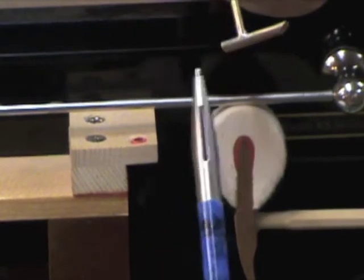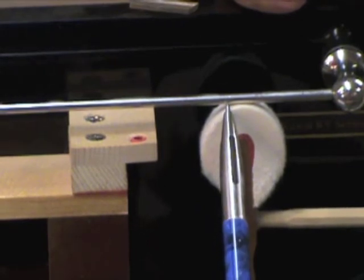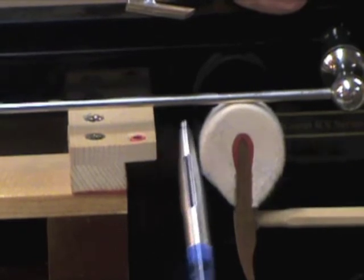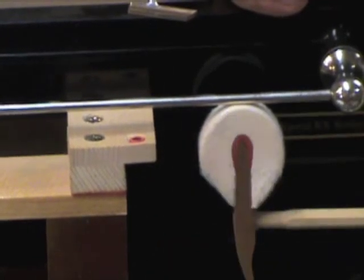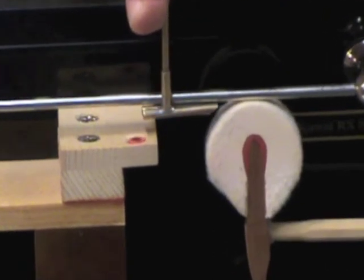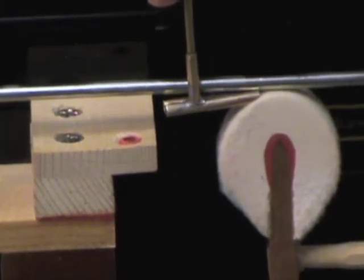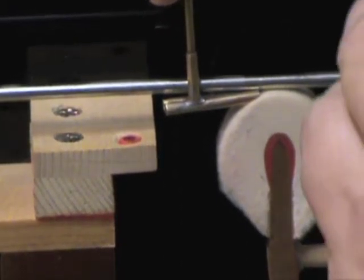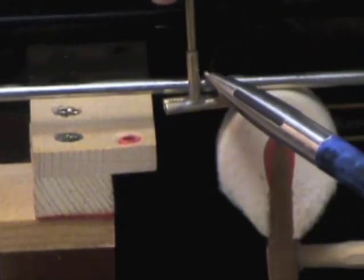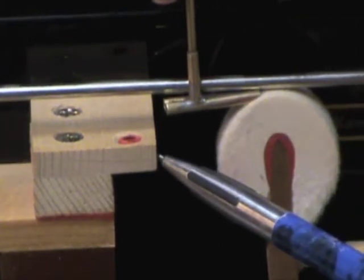We're going to measure from the contact point of the hammer blocked off on the string, to the front edge of the damper guide rail. We need to know how much space here is available. Sliding the L jig under the string up to the contact point of the hammer and string, viewing down from above, what is the relationship of the shaft of the jig to the front edge of the damper guide rail?